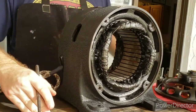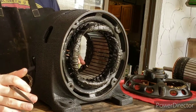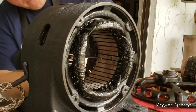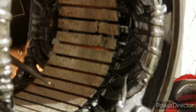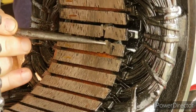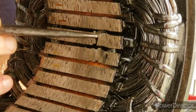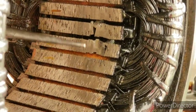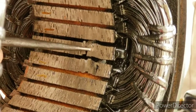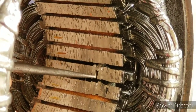When I was discussing the rotor, I mentioned that the rotor at some point had crashed into the stator because the bearings had worn out. Inside of here, I had to go along and straighten out these segments like I did on the rotor. There are a couple over here — you can see right in this area — I was not able to get those straightened out, so I just had to leave them be. When the rotor had made contact inside here, it pushed a bunch of these segments out of whack and that was creating some problems. These were in there so tightly, I just let them be.